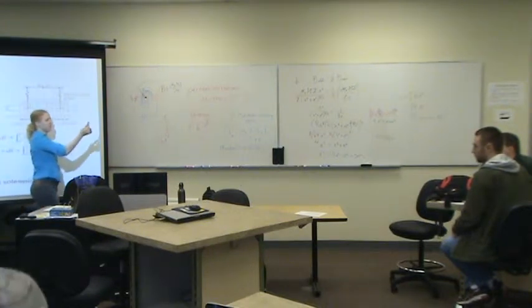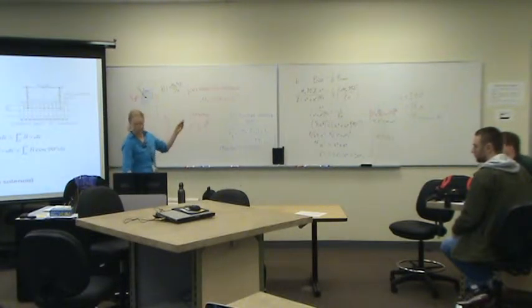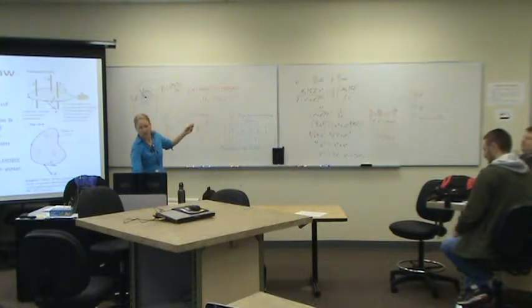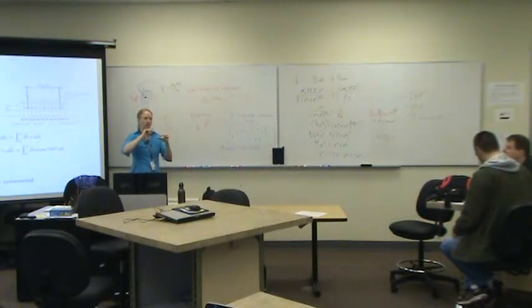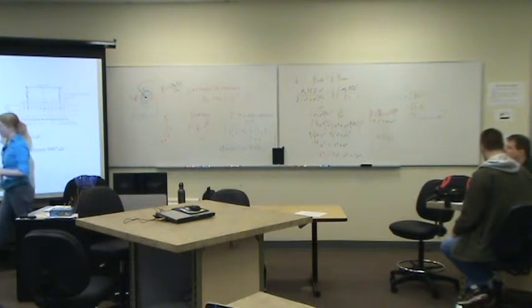But with the solenoid, your wires can't be overlapping the way that these are overlapping all over the place. We assume that this is just a coil, using all those equations, those 4 equations that we wrote down earlier. So to be a solenoid, you'd have to really carefully wrap this around a cylinder so that you only have one coil, nothing laying on top of each coil. And then they're evenly spaced, and then things will work happily in that case.